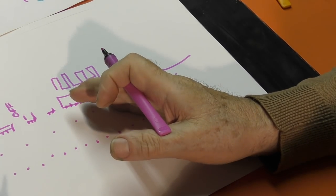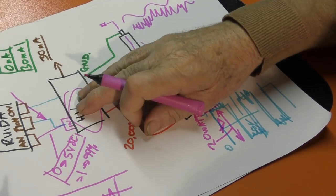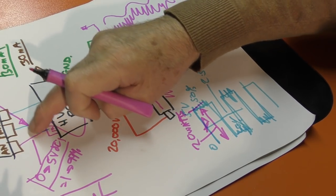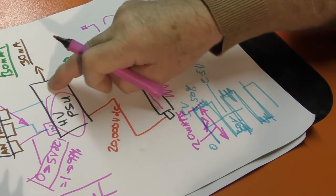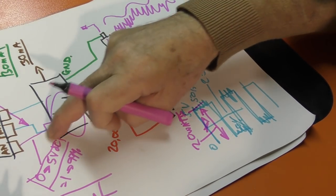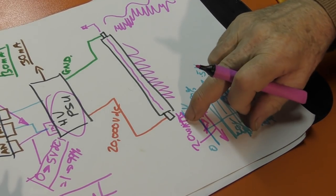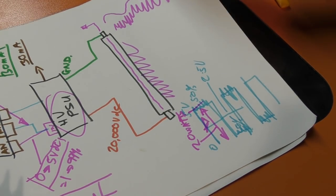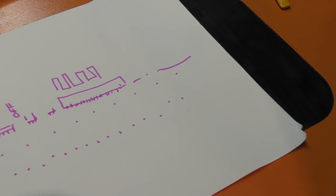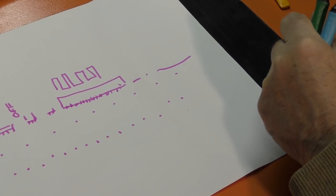That clearly shows me that this machine is not operating in the same way that an ordinary glass tube machine works. We're not taking the PWM signal and converting it into an analog signal so that we can get a nice smooth steady output. We're leaving this PWM as a raw pulsed signal so that we can produce a pulsed output. And that's the whole supposed magic of the RF system. The further I get into this, the more I realize that there is no magic, just a simple pulsed signal.